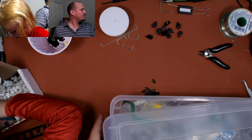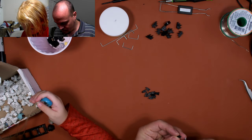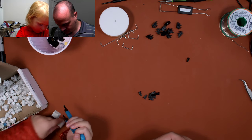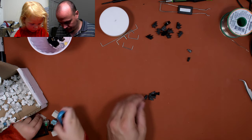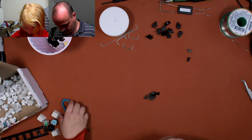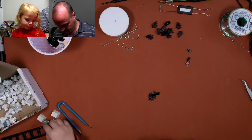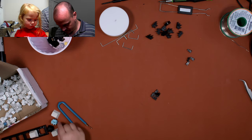I don't have enough room to plate mount stabs. But these ones actually felt okay to me. I'll just clip them and lube them, and they should be fine. This board has clicky switches, so I feel like the sound of the stabilizers is probably just drowned out by the sound of the switches. I don't think it's as noticeable.